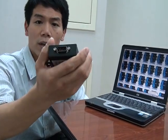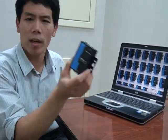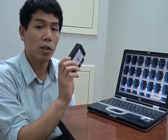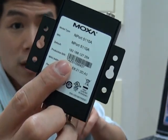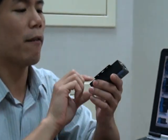It has one RS-232 serial port. So let's say we open the box and we're ready to deploy it in the field. Before we begin the configuration, the first thing you're going to do is take a note of the default IP address. We've printed it there on the back for your reference — it's 192.168.127.254.